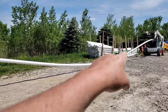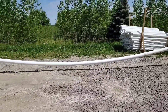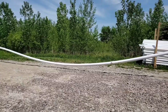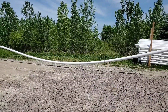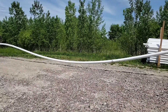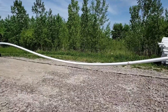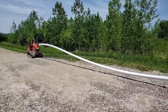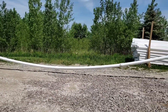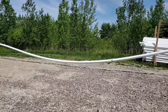You can see under its own weight the sag. I have a skid loader on each end — I just pulled these right off our PVC pile to do this demonstration. If the yard has an area that's wetter than surrounding areas, PVC does this because you don't have hangers in your yard. Indoors, approximately every five feet you have hangers holding this stuff so that it's straight.